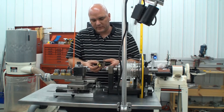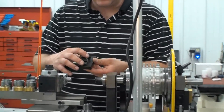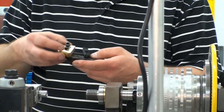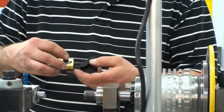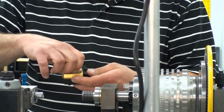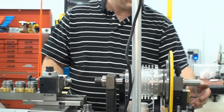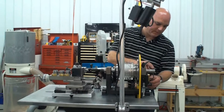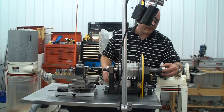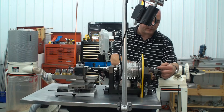The piece is mounted to the back of the headstock by means of two socket head screws and it simply bolts on. Then the follower rides in the channel and is pushed up with the lever and locked in place. The unit back here is very convenient and easy to use. The thread bobbin slides on and gets locked in place with the set screw.